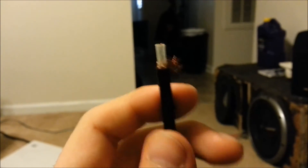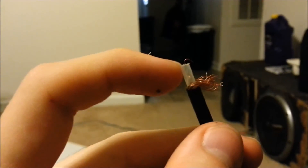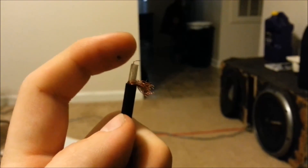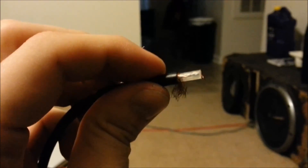The plastic on the inside only has one wire going through it, which will be your positive, and all of the surrounding wires are going to be your negative. So if you want to extend or cut it short, both the negative wires are going to go together — put those together as your negative — and connect the inner wire as your positive, and you can extend or shorten as you please.